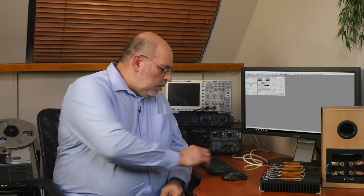You can easily forget this if you don't get it, or Google loudspeaker impedance measurement if you want to know more. When you listen to this video over headphones or a large stereo, you can hear the measurement tone start at 20 Hz. From there it goes up to 30 kHz in 200 steps, and after each measurement the next frequency is generated, measured and plotted. Whatever you do, don't increase the volume. Measurement tones can cause damage when played too loud. Okay, here we go.